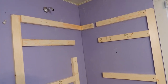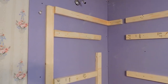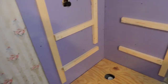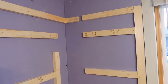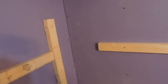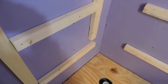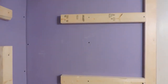The skeleton for the shower stall panels is now attached to the wall. This is the configuration the instructions showed, at the right heights, leveling up the boards. The way this shower was designed, the perimeter boards are one-by-threes, but all the rest of the interior boards are two-by-threes, and there were certain sizes that had to be cut — a lot were the same so I didn't have to be specific with every one.